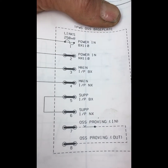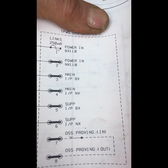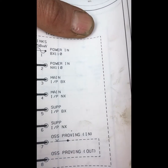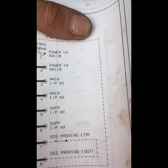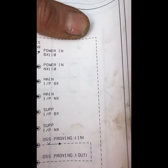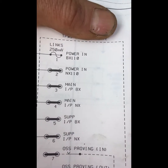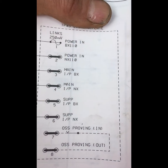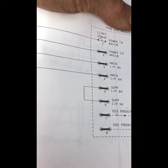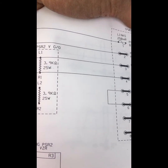On the diagrams you'll see you have the 110 volt positive and negative links coming in at the top — that's 110 volts AC. Then you have the main inputs to drive the module on lines three and four, followed by the suppression link on five and six which is strapped around. You also have the OSS proving — that's the over-speed proving — in and out links on seven and eight. This one doesn't have an over-speed module because it's just used as a permanent speed restriction. You can see your four lines coming in from the left-hand side from your 110 volt power.